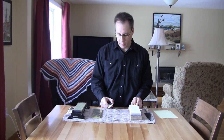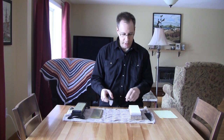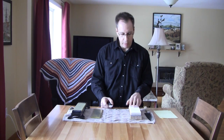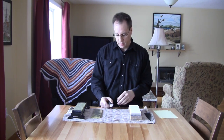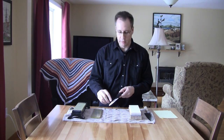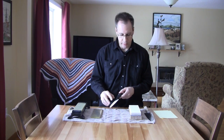So then I decided to go with my 8000 grit Waterstone. But I wasn't sure if it was going to sharpen because the ceramic blade is just as hard as this. And after spending about an hour on it, finally the blade got perfect. I looked at the edge of the blade under the microscope, and it was finally perfect. There was no more chips.